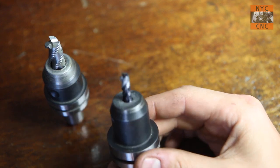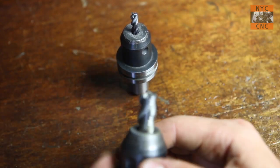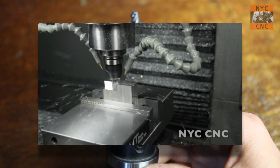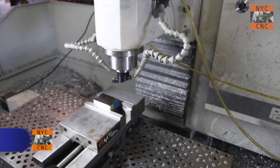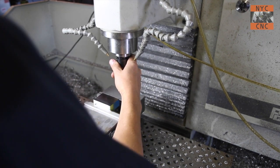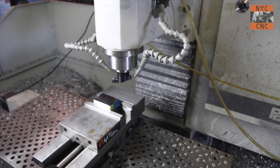The one you can see here is our Lakeshore Carbide - it's a four flute, quarter inch. The other one is my Maritool half-inch three flute, which I love. It leaves a great surface finish, I can really hog with it, and there's a video where I push it to the max with the Tormach. Let's go make some chips. I just faced off this block with the Tormach Superfly - one of my favorite tools for both material removal and surface finish. We're going down 350 thou in two passes, so that's 175 thou depth of cut, full width of cut at a quarter inch, 5100 RPM max on the Tormach, and we'll start the first cut at 25 inches per minute.